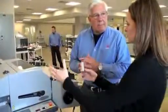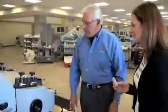So is this just larger format? I mean, why would I use this versus the other one? Just to maintain good stacks of material. It's ideal for signatures. We don't sell a bander, but you can add a bander to this so that as these stacks come out, let's say 16-page signatures, you can wrap it with a paper or plastic band and then move it to another area of the shop, rather than worry about that skid tipping over or losing the control. No, that makes sense. Control of the signature.